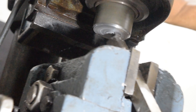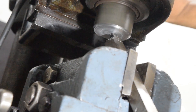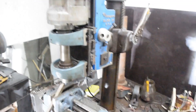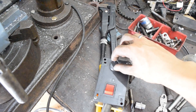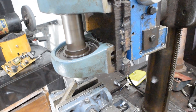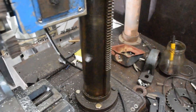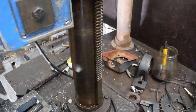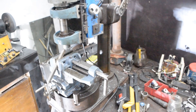Here I'm forcing the feed to trace where the vibration is mainly coming from, and I found out that it's the post. The milling head is fairly solid now, but most of the chatter is coming from the vibration of the post. It's cast iron and somewhat thick, but I guess it's only designed for drilling. So that will be the next thing I will be addressing, and I think I already have an idea how I will strengthen that post.